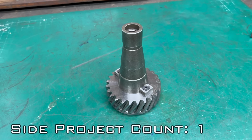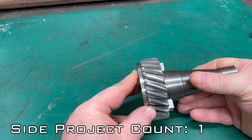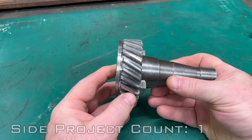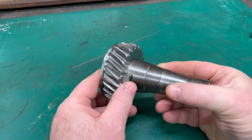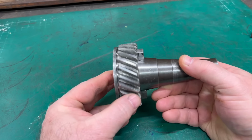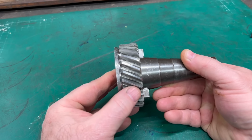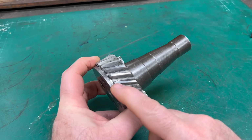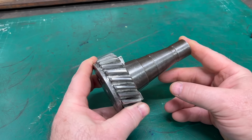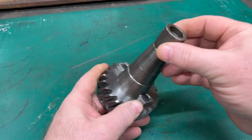If I'm going to reach my goal of machining all these surfaces in one setup, I need to use the universal head for the K&T. This is the setup that I have for the drive gear for the universal head that uses the gear that was made for me by my friend Cooper. Because of the way that this was made, the gear teeth on this are not consistent. There's some differences in thickness, and it was a good experiment on Cooper's part, but it created some problems on the K&T.